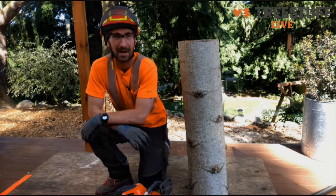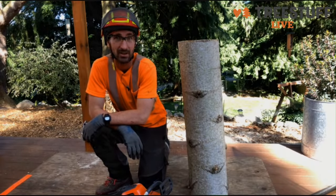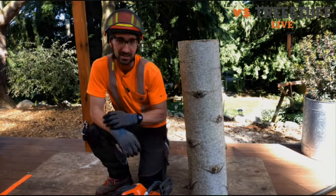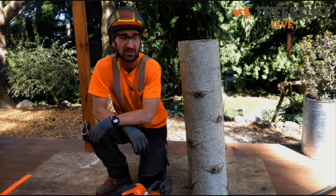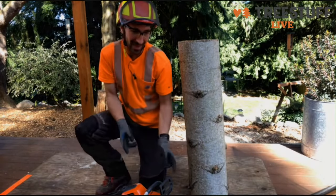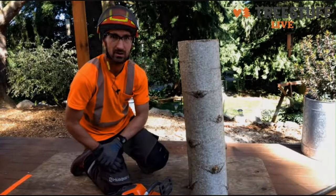We're trying to maximize board feet. Yeah, exactly. When we're trying to maximize board feet on a tree that we're falling in a logging setting, the goal is to cut as low as possible and to not put a big face in the usable wood, in the saleable wood. So that's where the Humboldt notch comes from because it turns it upside down. And I think that's often where kneeling comes from because it puts my cut lower.